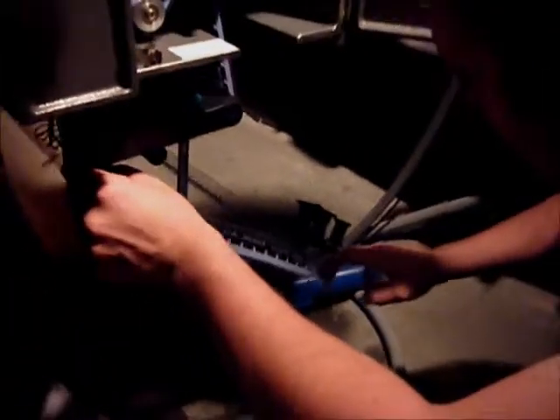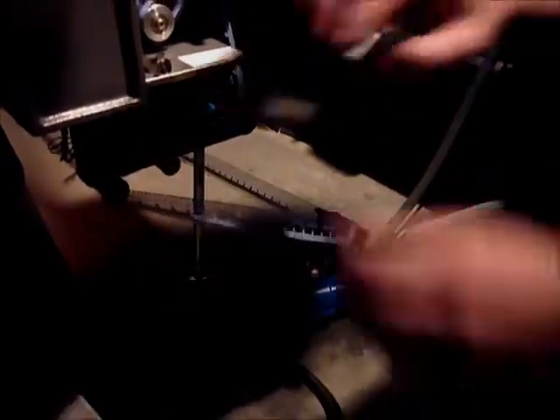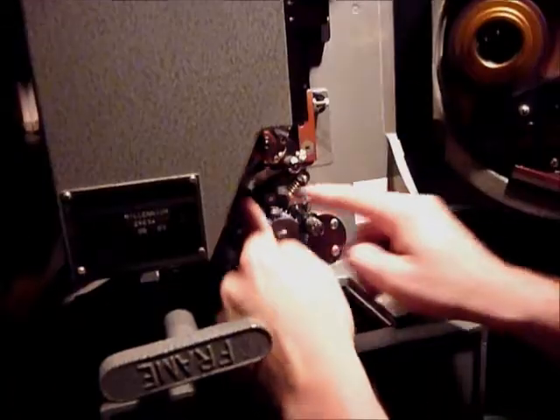The line is back up here. Put it back on our path. Our whole Z threading here got messed up — we'll fix it. We'll try this one more time. Give it a go over here on the sound deck — very gently, you don't want to pull too hard or something like that will happen. The projector is officially threaded. Actually, we need to adjust this right here — one sprocket because it was too tight.